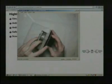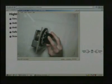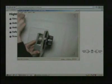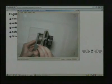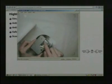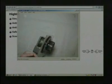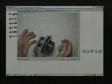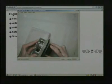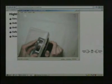Let's get into safes for a little bit here. A lot of this stuff was sort of acquired at the last minute, so I'm kind of figuring things out as I go here. With a safe, you have 3 little rings here, and on the back, you have a cam and a drive wheel. Now, you've probably all taken apart one of those Master locks when you're in high school or sat there trying to figure out how it worked. Well, this is basically just a much larger, much sturdier version of it.